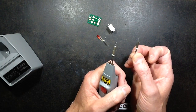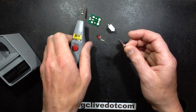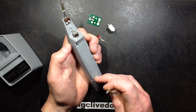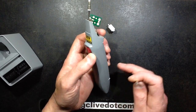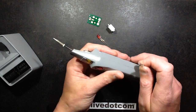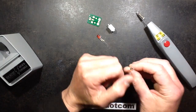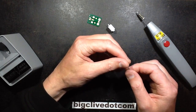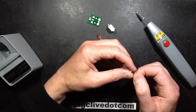And they have a really staggering array of these bits. Now, the bits are interesting. This thing contains two standard 1.2 volt rechargeable cells. They're NiCad, which is odd. I was expecting nickel metal hydride. I thought, you know, in this day and age they'd have changed the technology, but I think they may have stuck with NiCad because of its maybe preferred current delivery abilities.